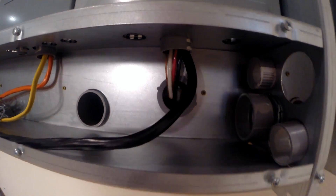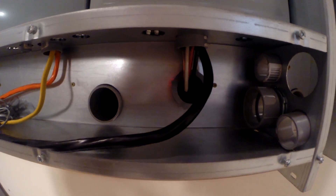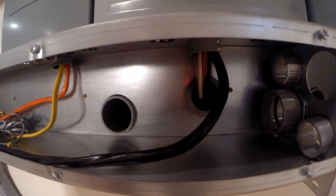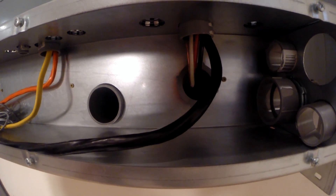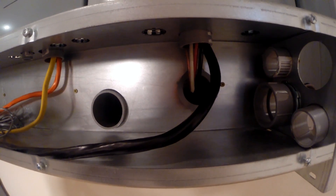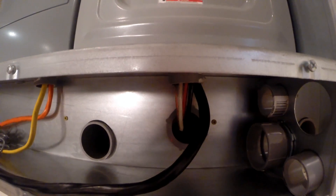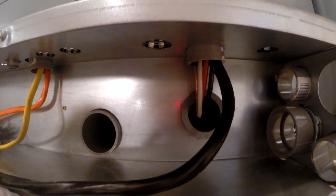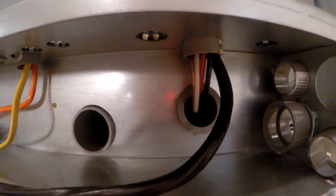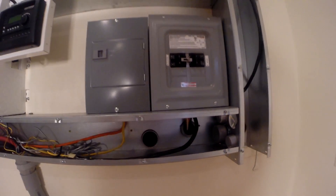Here's another thing: my backup generator wiring — I used six gauge wire, but the plug I'm using really isn't rated for six gauge; it's only rated up to eight gauge. It's better in the sense that it's heavier wire and can carry more current, but it's really not needed since it's only a 30 amp plug. The problem is that using this heavy gauge wire, it does go into the connectors, but there's not really enough room for them to bend the way they should coming out. I might actually go back and change that to some smaller gauge wire.